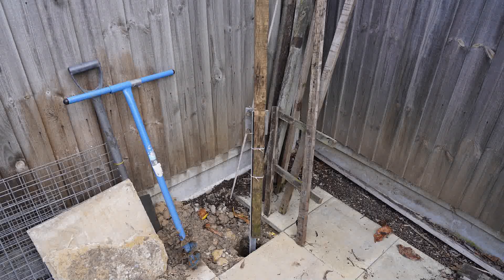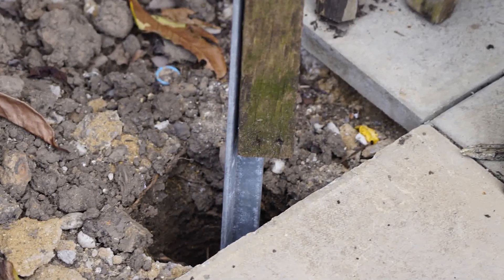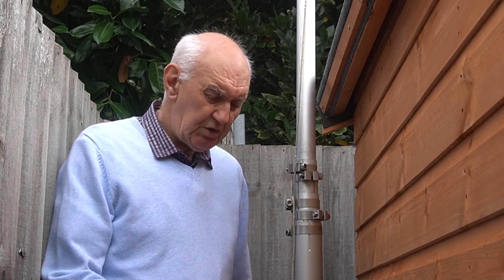I went down around about two, two and a half feet I suppose, and then I got some fence post cement. Now this is quick-drying cement. I was a bit worried about the strength but it seems to be pretty strong, and all you do is you pour the dry cement mix down the hole, fill it halfway up, and then pour water into it. If you need some more, put a bit more of the mix in and water in, stir it around a bit, and within about 10 or 15 minutes it starts to set.